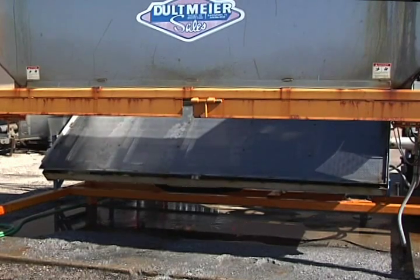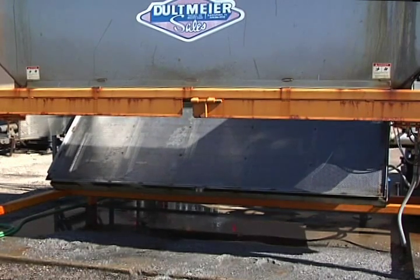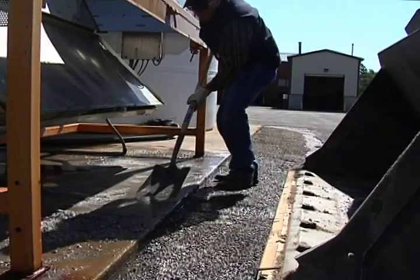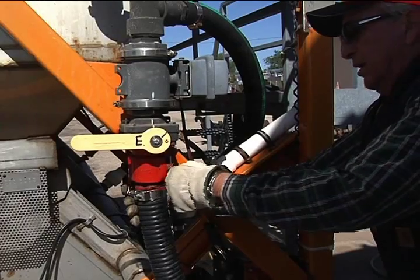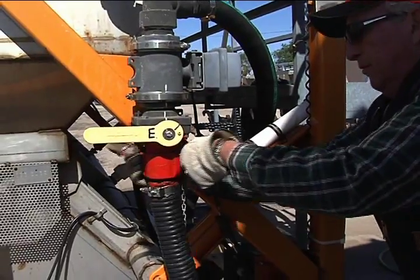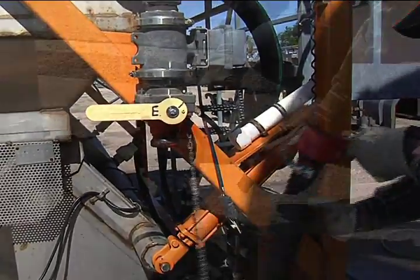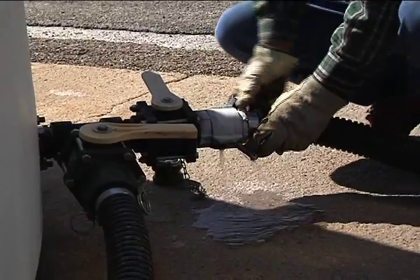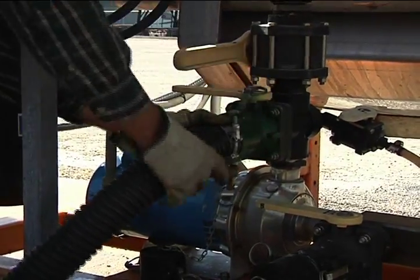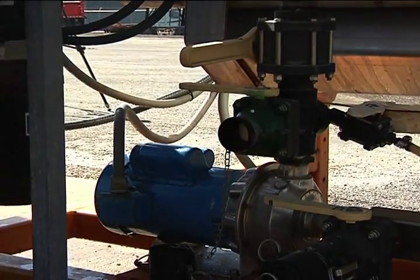The salt residue left in the lower tank on the trash screen can be mixed with salt sand in small quantities. All salt piles should be cleaned up and the ground and equipment should be washed down. Shut off all valves on the storage tank and to the pump. This includes tanks, valves, connection hoses, and pumps. Take off all hoses and store in an appropriate location. Put all valve plugs and caps back on fittings.